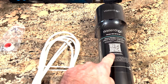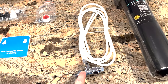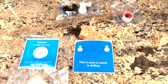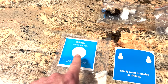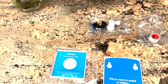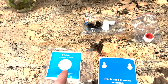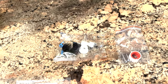The kit is really nice. It comes with a T-tap to go under your sink — I'll be installing that on the cold water side — and then lines that go into the filter and up to the dispenser. It comes with thread tape, mounting screws, a template to show you where to put your screws under the sink, and a sticker to help you drill a hole through your countertop if needed. It also comes with extra fittings. So let's get started.